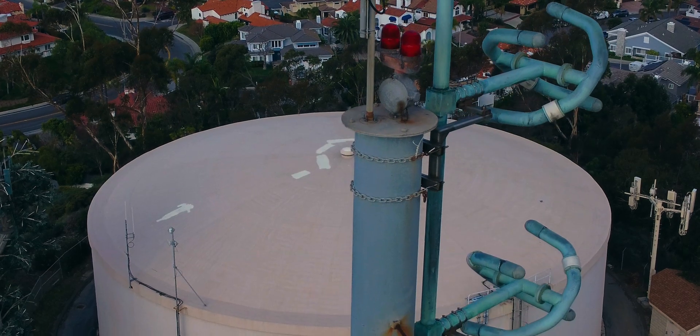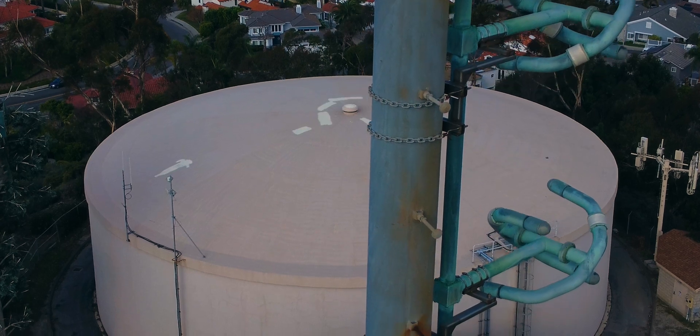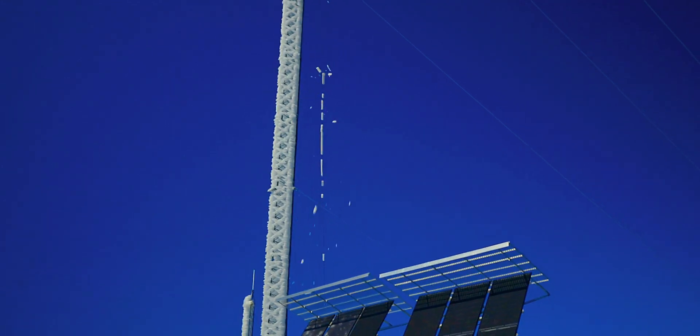There are a couple of ways to deal with that — three ways, but we'll really talk about two and touch on the third. Way number one is an antenna heater. If you look closely at an antenna, it's basically made of metal, and ice will start to form on it because it gets really cold and that RF starts to bounce back. The heater is built into the antenna when it's installed. It doesn't get hot enough to burn you or cook eggs — it just keeps the metal warm enough to stay above freezing, so the ice melts off and doesn't build up.